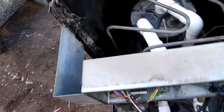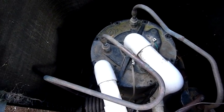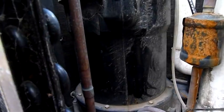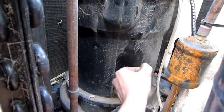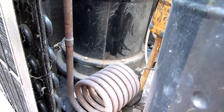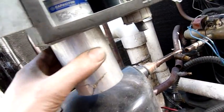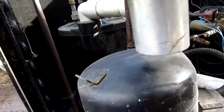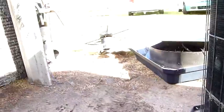We've got the top off the other one. As you can see, it's got a different kind of water heat exchanger — and a very ruptured one. This is the one that's split. You can see a nice big crack all the way down here. Looks like polypropylene, but it's ruptured rather badly. The fans are 480 volt single phase — even though they have a 5 microfarad run capacitor, they're still single phase. The neutral from the line in is completely disconnected — it's just L1, L2, and L3. Can't use those fans for anything else.